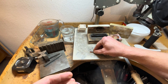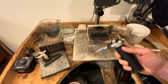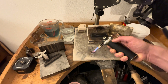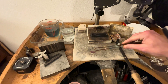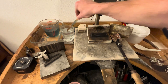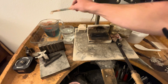Some believe in the sudden embrace of water to temper the metal, while others advocate for the patience of air to gently coax the ingot into its final form. We choose a harmony of contrast, allowing the ingot to air-cool first, embracing the slow descent into solidity. We transition the flame from oxidising to reducing as the ingot solidifies, ensuring purity and perfection. The ingot is then prepared for annealing — the flame rekindled with purpose. Using the wisdom of tradition, the annealing process promises renewal. The ingot, reborn in the heat, is then quenched in water, a swift, decisive act that seals its strength and ductility, readying it for the next steps.